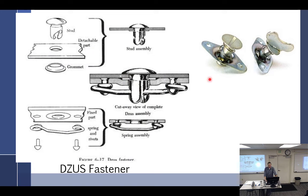Okay, so these are quarter turn, or it's a quarter turn fastener. You just turn them a quarter turn. These actually take a special little wrench called a Snoopy wrench. They're kind of cool. Or a dime, or a flat blade. Or your dog if you get it right. So these are just quarter turn. They're non-structural. You just push in, turn a quarter.